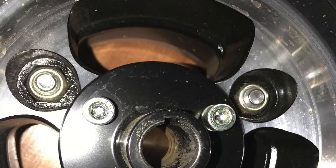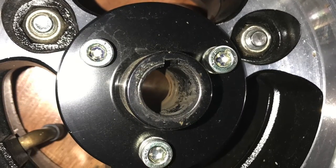The new chair has been working out pretty well, but there's been a few little things I've had to fix on it. The hubs that go on the motors that the wheels attach to — the wheels are this aluminum material and the hubs are anodized steel, with two big flat surfaces that ride on top of each other. They didn't use centering hardware. There's three bolts to hold it on, and without centering hardware things get a little crooked. I was getting this weird crunching, an obnoxious sound, and when the wheel turned there'd be a little bit of movement. I'm gonna have to find some centering hardware, or maybe I can make my own with the lathe.